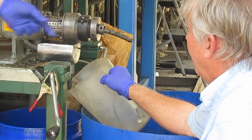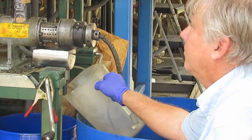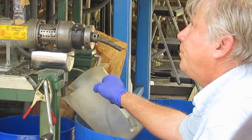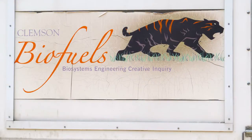You'll see some different kinds of filters when we get out there today. So to summarize: oil comes in, you remove the water and sediment, heat the oil to 130 degrees, mix up your methoxide, induct methoxide into the reactor and react for about two hours, drain the glycerol, biodiesel goes into the wash tank, remove the water and methanol, then pump it through filters and ion exchange, and wind up with your finished biodiesel.